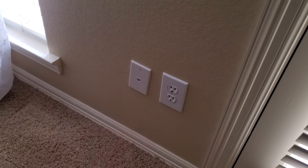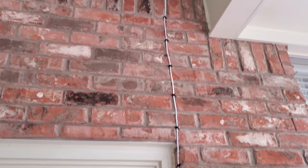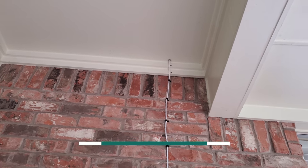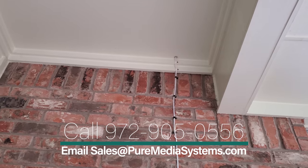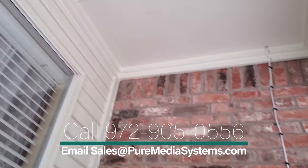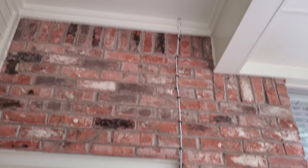The new wall plate with the Ethernet port here, right outside the door. You can see the cable, how we've got it sealed with silicone coming up, nicely tucked right inside the door frame there, and it is also sealed with silicone there, a hole slightly larger than the cable, so we can feed it through with magnets, because like I said, I was about right over here. It's as far over as I can get with the roof line physically. So I use fiber rods and magnets.